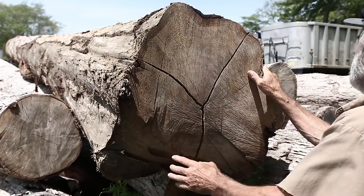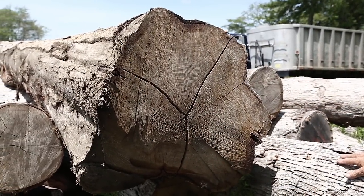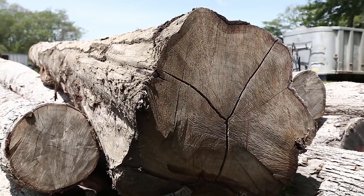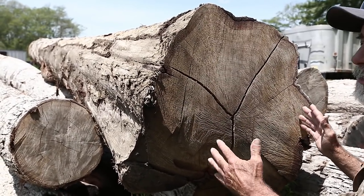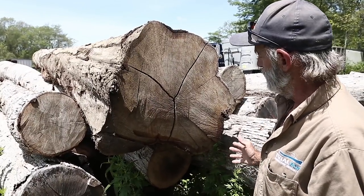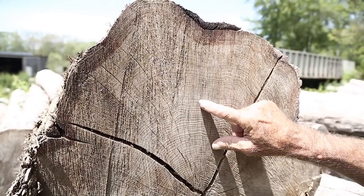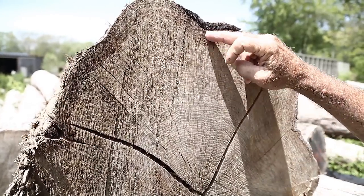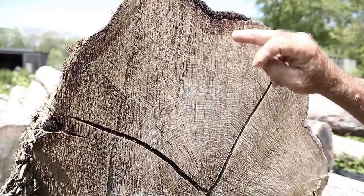Looking down both sides, it's a very nice straight log — not one single bunch or lump on either side or on top. That log might have some mighty clear stuff in it. The mill owner and I both looked at it and agreed this would be the best log for me to purchase. I'm buying it run of the mill — they want me to take the entire log, and that's what I'm going to do. The annual rings are about an eighth of an inch wide, consistent all the way up. That tells me there wasn't too much weather or disease affecting the growth — it took off at one rate and finished at the same rate.